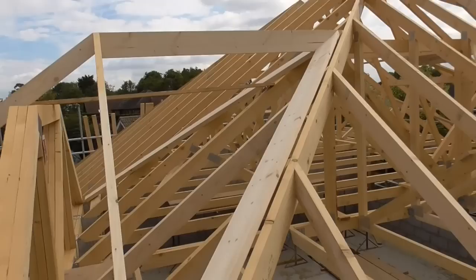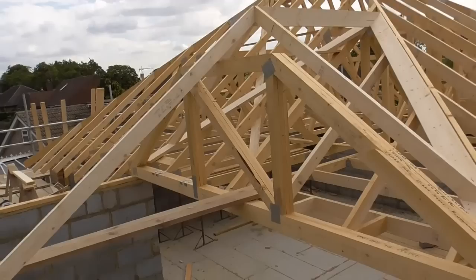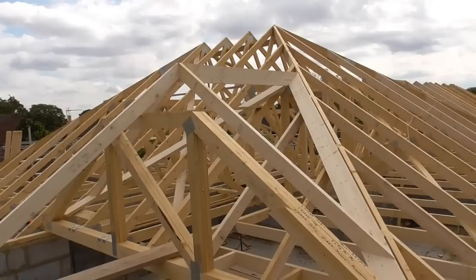and then it's a simple case of lining these hips through again, and I might have to bird's mouth them over that flat section of that girder, I don't know, but once these hips are in, then we can infill the rest of this, and then that's pretty much that job done. So yeah, really happy. I'm going to have a sandwich now, it's 10 o'clock.